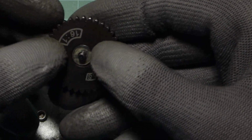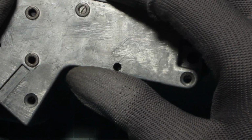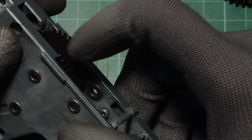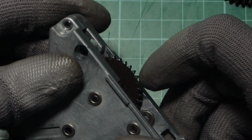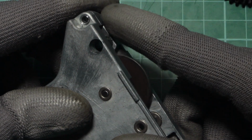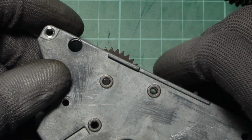After the shim has been placed, I test the effectiveness of the clearance by closing up the gearbox and turning the gears by hand. Initially, the spur gear still hit the bushings when turned, but closing the lower gearbox shell removed any axial play and revealed that the spacing was just right, just enough to clear the bushings, and as low as I could get it.